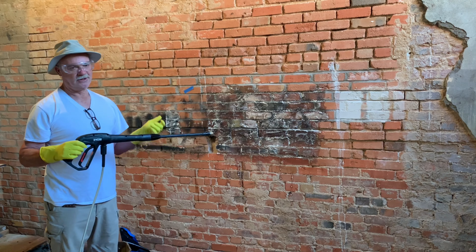When you rinse the graffiti off, try not to follow the pattern of writing, because I have seen people etch into the surface with the pressure washer. That's why a thousand pounds or less and a 25 to 40 degree nozzle is important — it minimizes the chance of biting into the substrate. As you can see, we're pretty much finished. We've got a good line here where we cleaned. We'll let it dry and see how it looks, and then we can revisit on the next video. See you next time on the wall at the Mapero Brick Academy. Thank you.